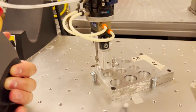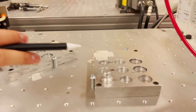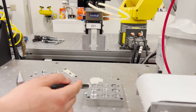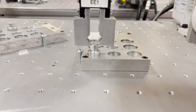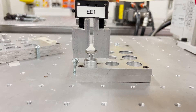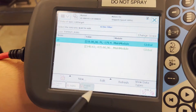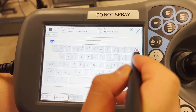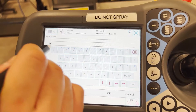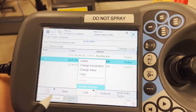Repeat the same process. We now enter the plate 2 work object and move to a configuration where we can pick up that point. We are now in the position to pick up the final point. To test it, we close the gripper and reopen it. In this position, return to program data, new, and we will label this B1. Leave the settings as they are, edit, modify position.